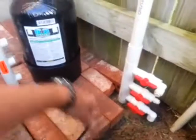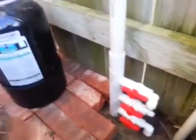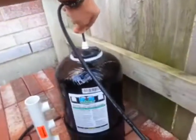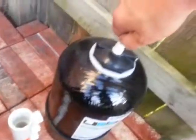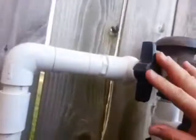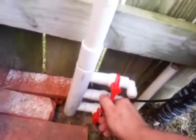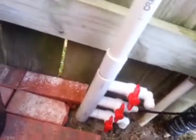Now, once we've got the ball valves in place, all we have left to do is connect our hoses and tubing. Quarter-inch tubing simply pushes in there and then into the top — you want to make sure it pushes all the way down and sets properly. If it doesn't, you'll know pretty quick when you turn it on because it'll leak; just turn it off and push it back down. Notice that while I'm doing this, I have my backflow preventer shut off — it's a good idea to keep these valves off so we don't have any unnecessary pressure.